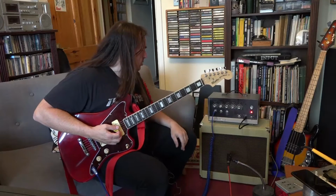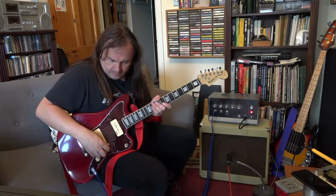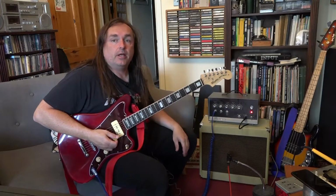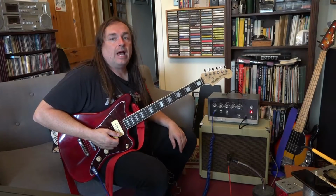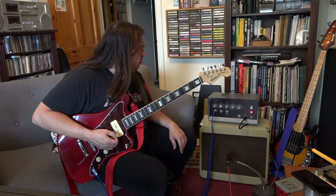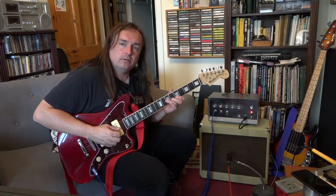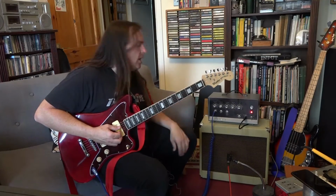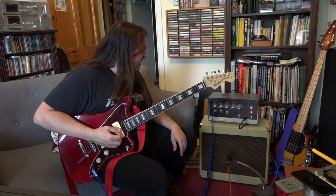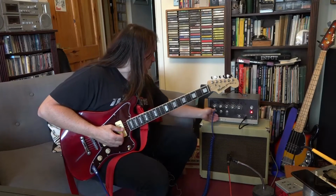So yeah, it's got a good little clean tone. It's not as loud as mine, and I think a lot of that is probably due to the fact that the valves are older and it probably needs those power supply capacitors changing, because it is humming. So it is humming a bit, and that's not so good. It definitely needs some capacitor work, but all the inputs work.